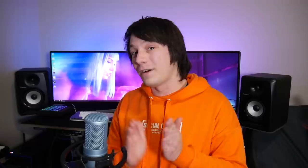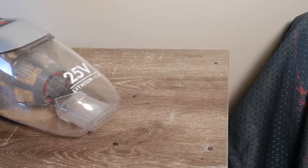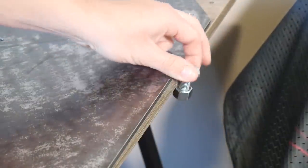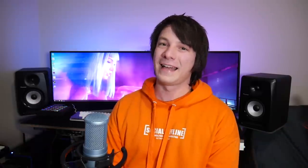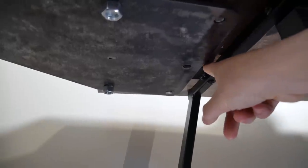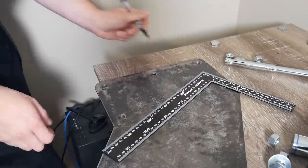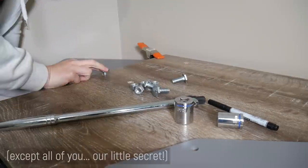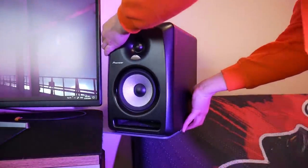Because the speakers overhang quite a lot, mounting them to the desk needed to be overkill. I originally planned to use M6 tapped threads but couldn't be bothered tapping 6mm steel twelve times, so I found massive M12 bolts at Bunnings with big heads — no washers needed. Unfortunately I completely missed the bracket under the table where the legs attach, so the wings would intersect it. I had to use the grinder and drill press to notch them out, though thankfully that mistake is hidden under the desk.